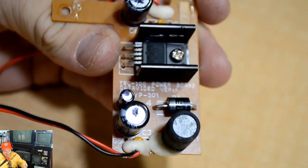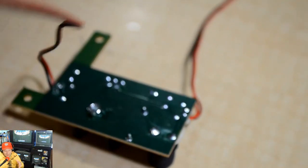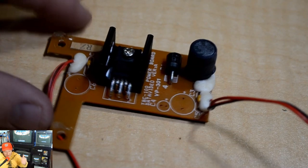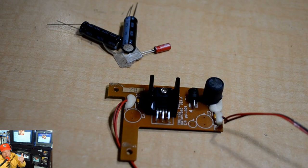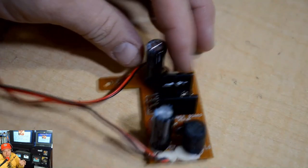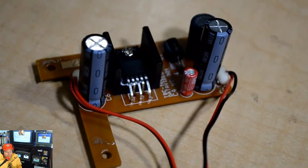Here are the three capacitors on the tiny Data Video power supply daughter board. We're going to change all three. I've got them removed, and I'll put in some really high-quality components — almost three times the size of the prior ones, highly rated, some of the ones I use in my BVM kits. These should last a really long time, a lot longer than the ones before.